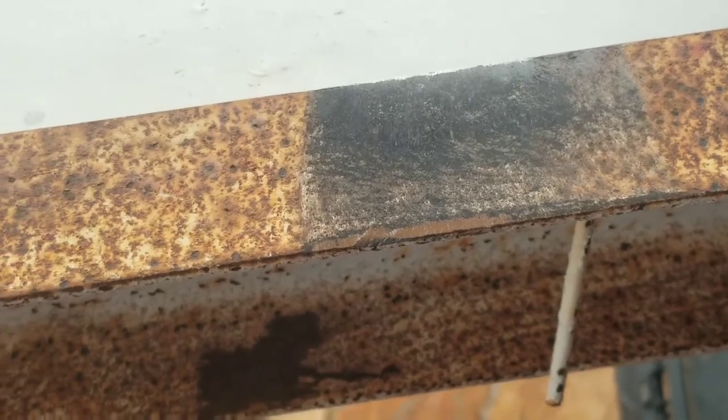Oh yeah, this might not be obvious to everyone, but wear breathing protection. Just something, anything to cover your nose and mouth when you're doing this. It'll catch some of the dust, some of the fine particles. Also, glasses of some form. Wraparound safety glasses would be better than these, but anything's better than nothing. You don't want to get metal in your eye.